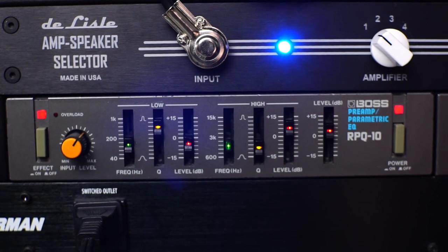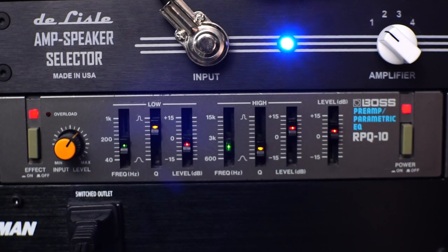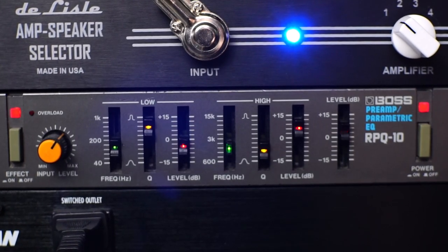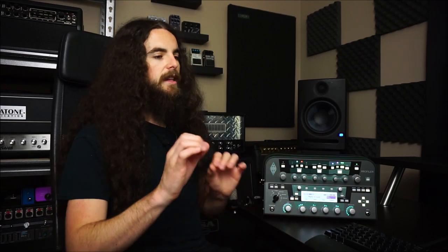With clean boost pedals, with pure EQ, even the slightest amount of symmetrical or asymmetrical soft clipping in front of an amp, through a Tube Screamer perhaps, I think the Kemper profiler does a fine job capturing that. The Rectifier profiles you heard throughout the beginning of this video, all boosted with EQ, sounded great. But some of the little gain stage nuances get lost, I think, for some of the more complicated circuits.